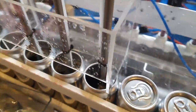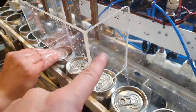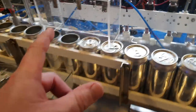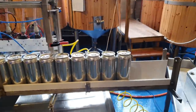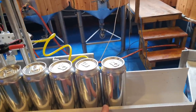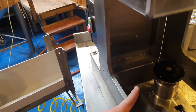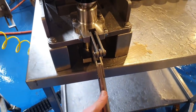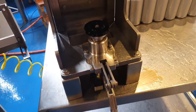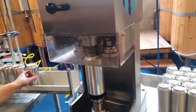We've got this little box — an afterthought — just to prevent the CO2 blanket from being blown away. In the future I want to make this automatically run onto the seamer and put some sensors in line, so we have a pneumatic rod that lifts the base plate and pushes the start button. Let's see the seaming process.